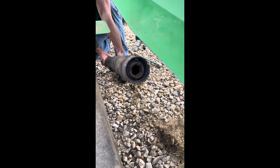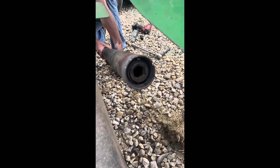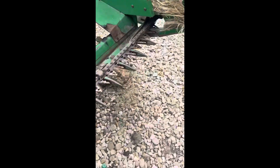We're going into the shop now. We'll take the snap ring off, run a tube up from the other end that's bigger than the bearing, drop it down on a block, and that'll pop the bearing out. Then we'll buff it up, put a new bearing in, buff this up, and we should be good to go. I'll maybe video one more time when we're doing that and give you the bearing size too.